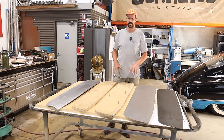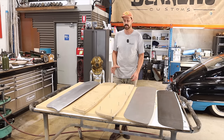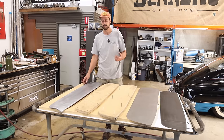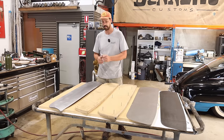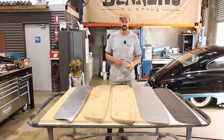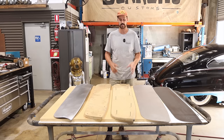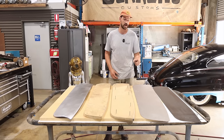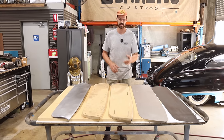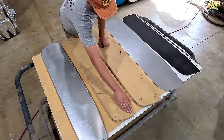I think for the other side, to be able to just turn it out is going to be really easy, purely because I know how much I can manipulate without having to use the torch or properly try and shrink these corners. Figuring out how much I was able to actually shrink rather than just pumping it through, it was cool to have that trial and error in there. And obviously I know that over an inch and a quarter, I think it was, is a lot to try and shape when you're getting into really tight radiuses, especially like what we have on the end here.